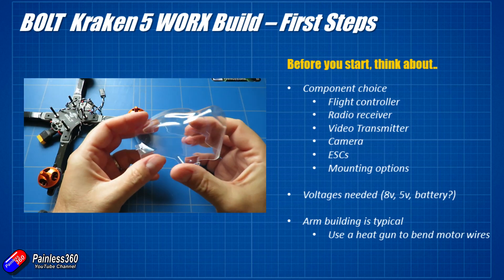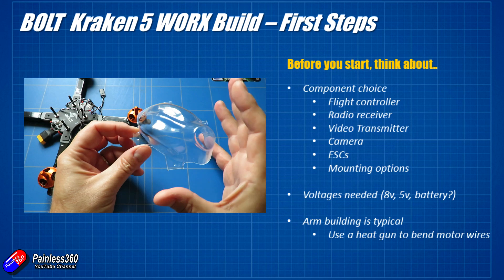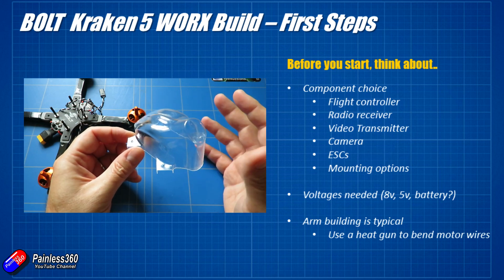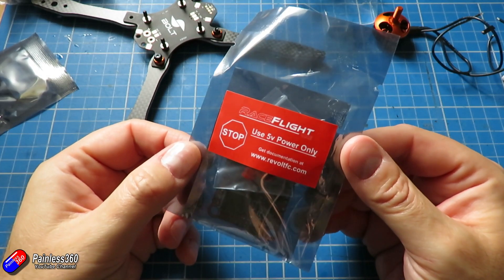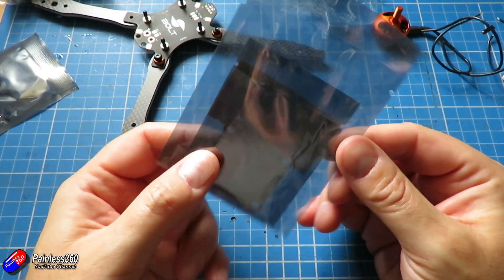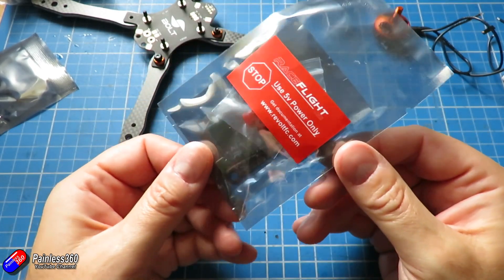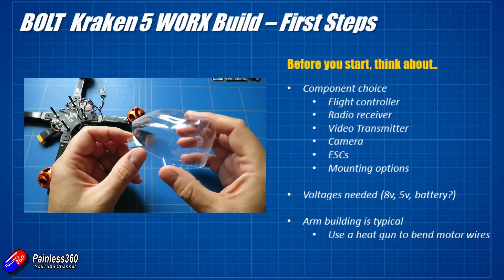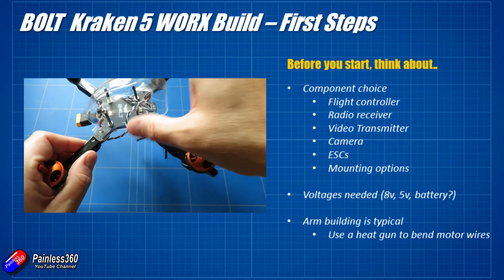You need to be a little bit careful and think about the flight controller you're going to use. First I was going to use something like a RaceFlight board but had lots of problems — lots of my friends who fly and race have had quads fall out of the air with those. Had to put lots of capacitors on to try and protect it from those kinds of failures, and that would look particularly horrific underneath this canopy.